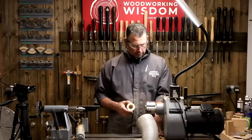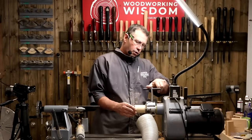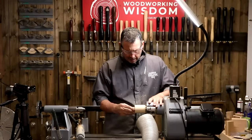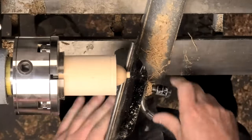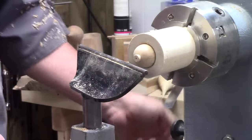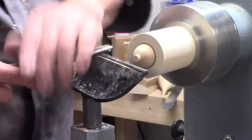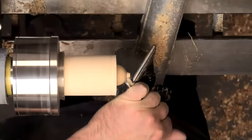All right. So let's tidy both of those up. I made earlier a little jam chuck for these. It might need adjusting because I'm not sure whether the size is the same as the first one that I'd done. And I don't want to thump things into this either. I want to put them in gently because I'm not going to be able to get them out that easy if I start thumping things in. So nice gentle cuts, extractions off and out of the way just in case. Let's be to zero, turn the lathe on, and we'll use a little spindle gouge for this. Gentle, gentle cut. And the best word of advice, if it comes out of the chuck, don't panic.